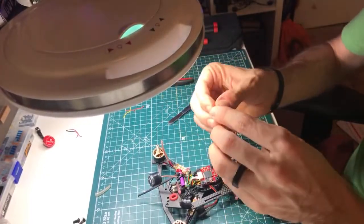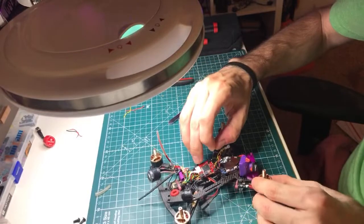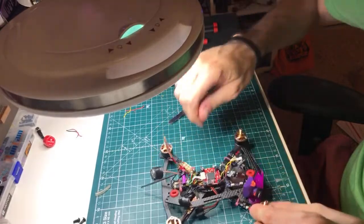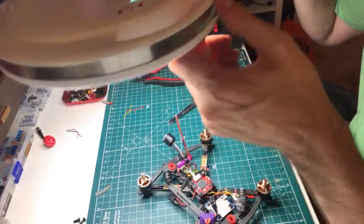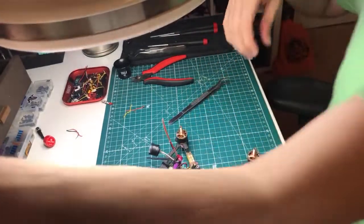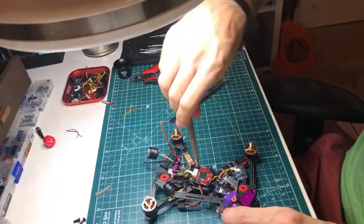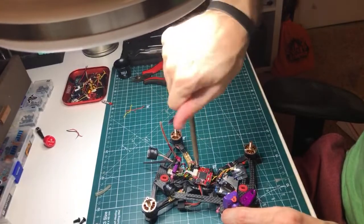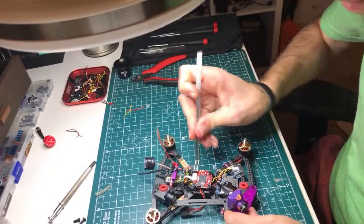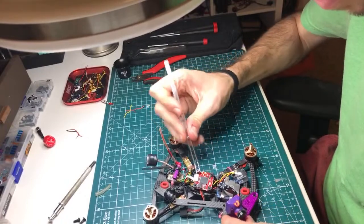So the lock nuts have, on the top of them where the nylon is, the metal actually narrows down. And with these guys, you can use that to your advantage, put them on upside down, nylon down. And, you know what I need? I need an M2 driver. I think I added one on Amazon, because the nylon on these is strong enough that my little grabber thing won't spin it. So you have to sit here and do it nut by nut with a pair of tweezers. Sometimes you even need to break out the pliers. It's just annoying.